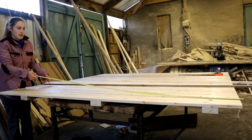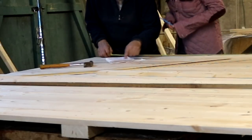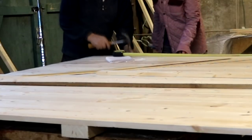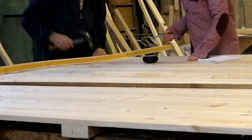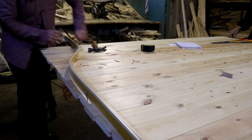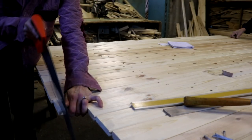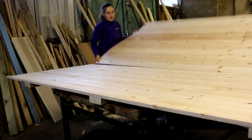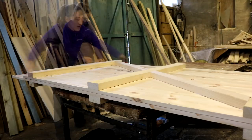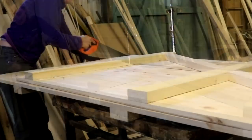The gates were too tall at this point, so we marked out the height, but instead of a square top my dad showed me how to do a curved one. He hammered in a first nail where the height was going to start, then a top nail at the highest point, worked out a nice curve, hammered some nails to keep it in place, and I drew around it. Then I pulled out the nails and cut along my line with a hand saw. We then flipped it over on top, made sure it was all in line, and mirrored it by drawing along the top and cutting again.